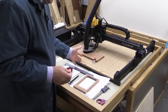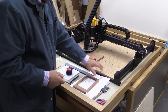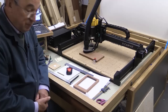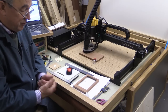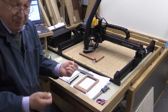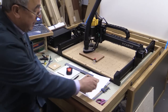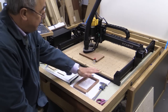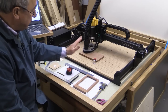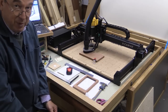The easier method, although you might think it more elaborate, is to put some shims underneath the existing wasteboard. Loosen up the screws which are all the way around and then put some shims under. These shims would have to be accurate to within about 0.1mm, so you need to find the right material — it could be thin clear plastic, paper, whatever. Double up, treble up, or whatever to get the height you desire. Check it with some form of caliper, position them strategically around, tighten the board down, and make sure that you graduate them.